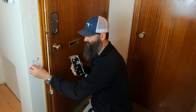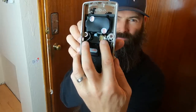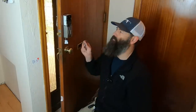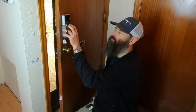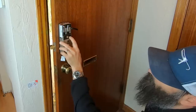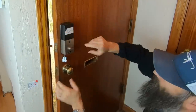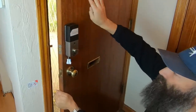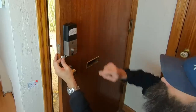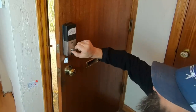For your last battery, you've got to press and hold the program button as you're putting it in. I'm going to leave that cover screw off in case I have to pull this back off and reset or restart it — that's in case it doesn't go according to plan with programming. I think that's a magnet. This device in this box pairs up with the lock and then pairs up with your Wi-Fi, which pairs up with your phone, your smart device. Everything's a smart device these days.